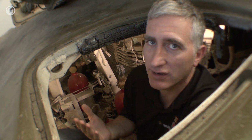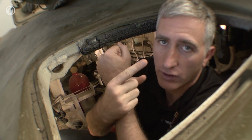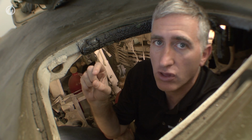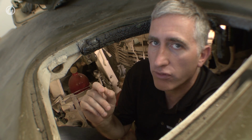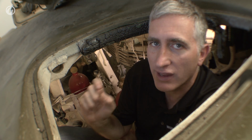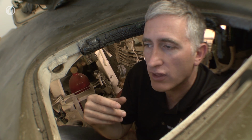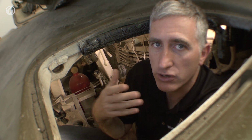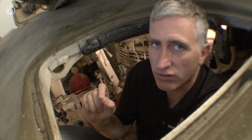If you look at, say, FM 21-60, written back in the days when you still had M113s and M60s, the hand-arm signal for neutral steer was something like this. And if you look at the label, that actually says neutral steer. You look at an Abrams tanker today though, and he's going to be a little bit confused because he will notice pivot steer. The problem was that with the newer gearboxes, as found on, let's say, Abrams and Bradley, you actually had to select a different position on the gear shift for a neutral steer capability, an on-the-spot steer. And since neutral had already been taken by neutral gear, no gear at all, they had to come up with a new name for it, so they called it P for pivot steer.